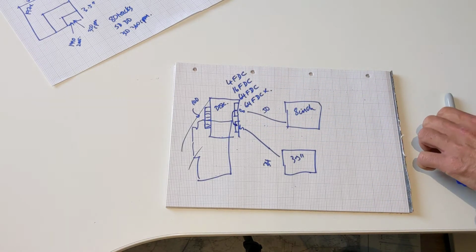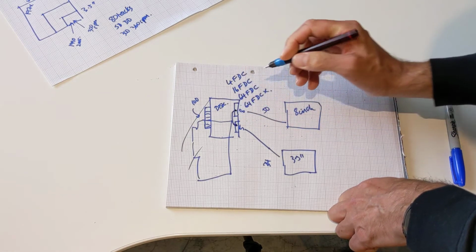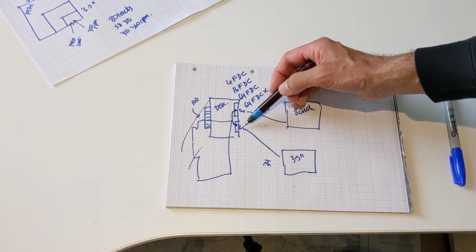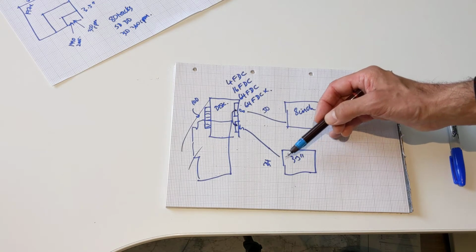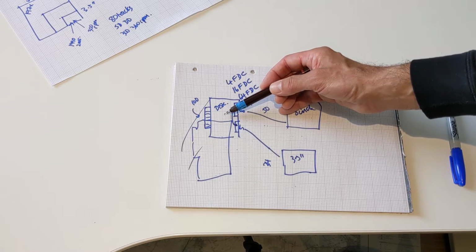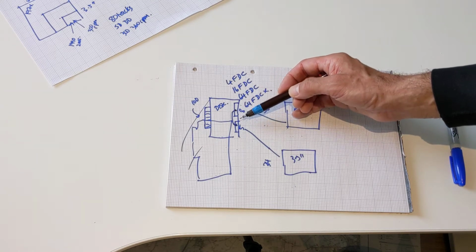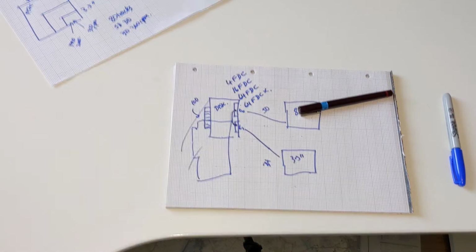Very messy diagram, I hope you can see this. So there's a few little bits of wire that need to change the signals that would go out on this 8-inch drive to the physical 5-inch drive interface, because 3.5-inch and 5-inch drives look electrically pretty similar. And they have a 34-way ribbon cable connector, but the 8-inch drives have a bigger 50-way connector. So on the disk controller card of the Cromemco, there's an 8-inch drive, large connector, and a 5-inch drive, smaller connector. So that is how this system is set up. Let's go back to the Cromemco system here.